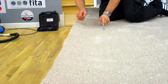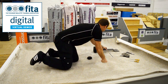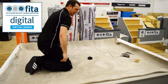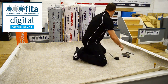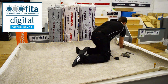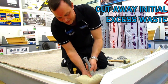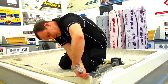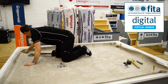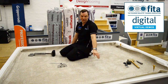We've got the row finder and we'll just run the row up the room, then just use a knee kicker to position the carpet and tap a brad hole in just to keep it in position. It's knocked in there straight in the room — it's pretty critical that it is straight. If you've got a pattern carpet, you'd see the pattern running off the wall.